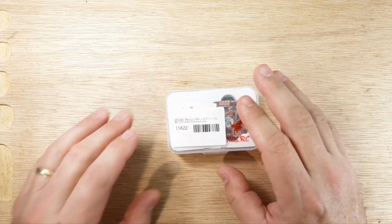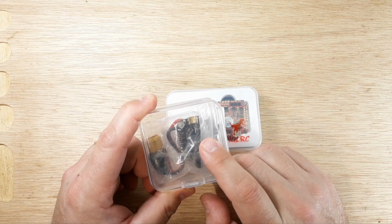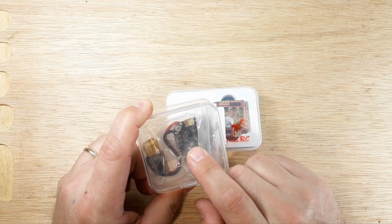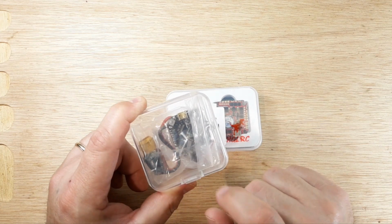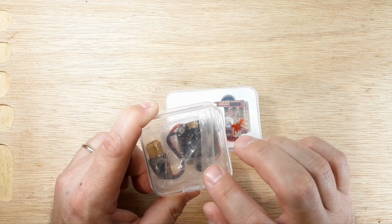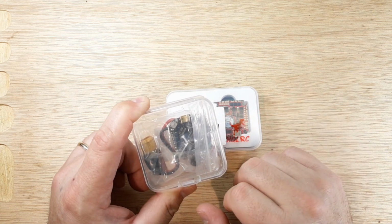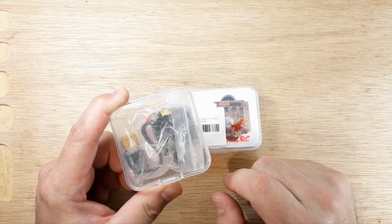So I chose it over this Beta FPV piece of garbage that I'm gonna have a friend of mine look at a little bit closer. It has voltage going through the OSD, so if you didn't want to black out your camera while you're flying, you would have to eliminate the OSD completely, and I don't want to get into that, but that's why this came out of the V1.